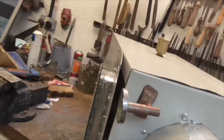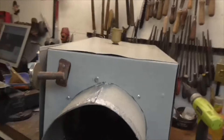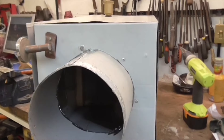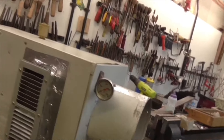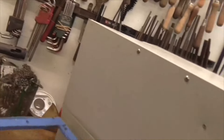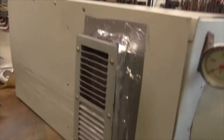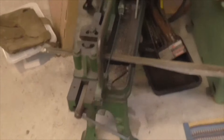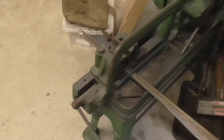The self-tappers aren't holding without putting clips on, which is a lot of faffing about. I can just drill the pop rivets out if I need to get into it. I'm not going to pop rivet it up yet until I've tested it to make sure I've got no leaks. The side vent, temperature gauge, and end nozzle are on — next is the fan vent underneath.